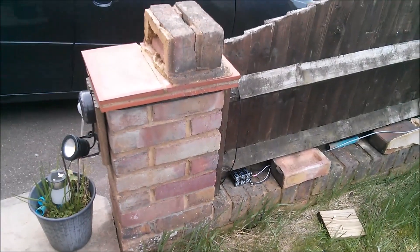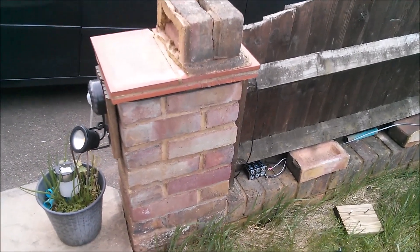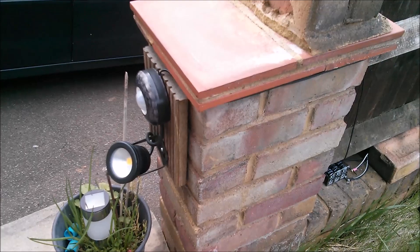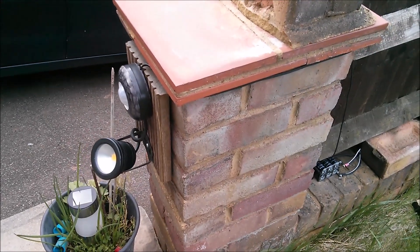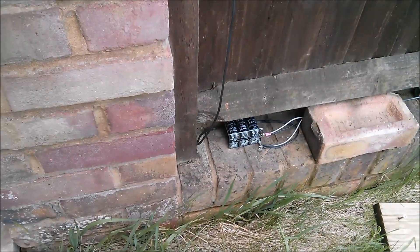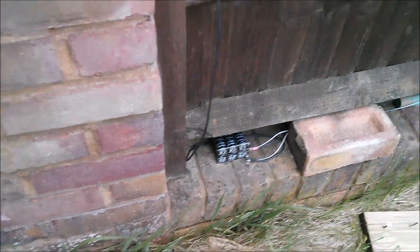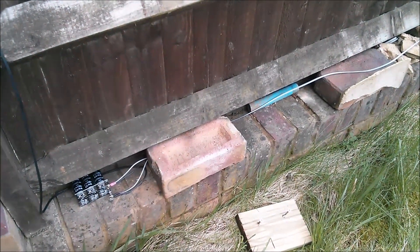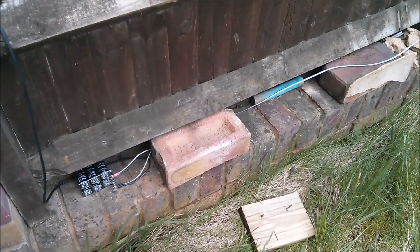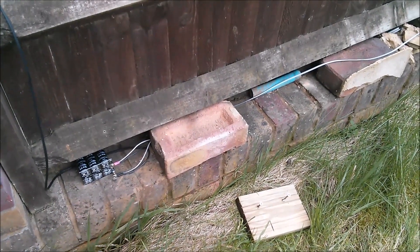So that's my large-scale outdoor decoupling capacitor application: a high-power load used only occasionally, a locally placed super capacitor as the local energy store, and a high-impedance recharge mechanism back to the car battery 20 meters away. It works, and I'm happy. Cheerio.